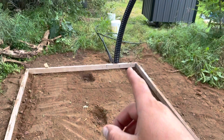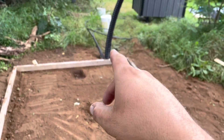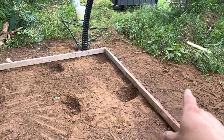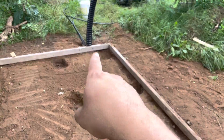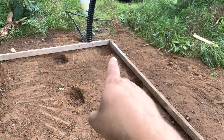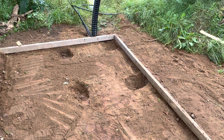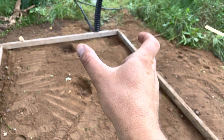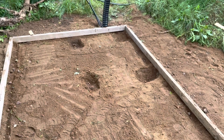I've got the Rhino — the insulated line — that goes just under the corner of the slab out here and then straight to the house. I wanted to keep it as close to the slab as I could in case I ever had to dig it out, but I left it on the outside of the slab because the wood boiler hangs over the edge with the feet.